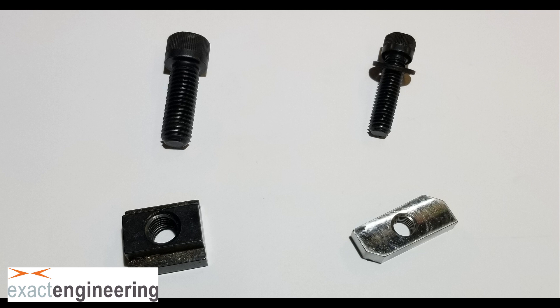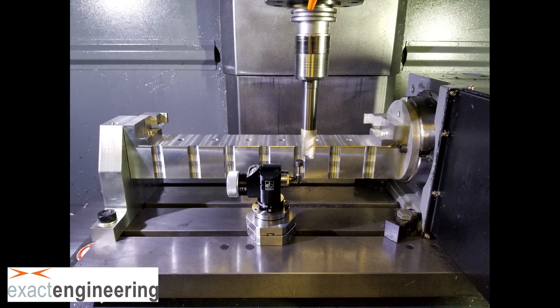On the left, you can see we have a half-inch bolt with a standard T-nut that you might have in a clamping set. On the right, it's shown an insertable T-nut with a three-eighths-inch bolt and this allows you to insert the kinematic base anywhere on the machine by dropping that insertable T-nut through the top of the T-slot rather than sliding it into the end. This allows you to install this on the machine if there's already items attached to the machine as shown.